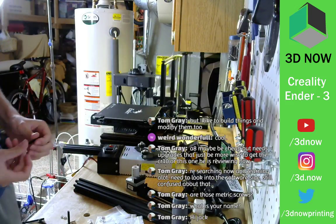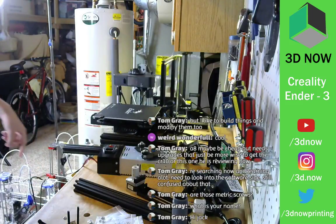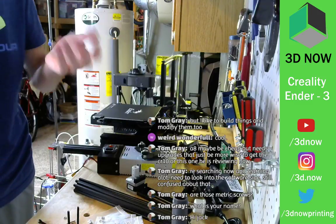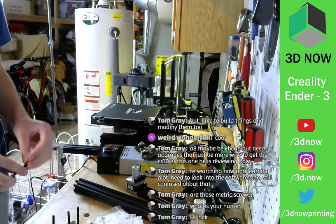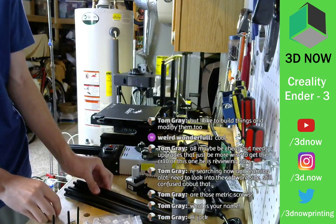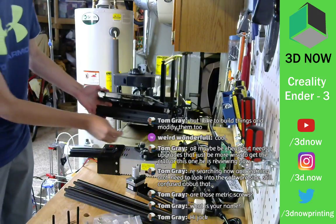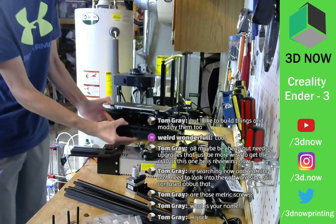And this is most clone Prusa i3s, and even the original Prusa i3, they have these acrylic frames, or metal, but like these super thin-walled frames. Well, I guess for the original Prusa i3, they build theirs very, very well, but these Chinese ones, with just acrylic, they're not very stable at all. So with CR10 having 2020 V-slot aluminum, this thing is gonna be a beast. It's gonna be solid as a rock. So, stick this here. There we go, much better.